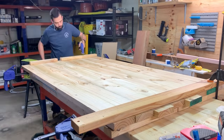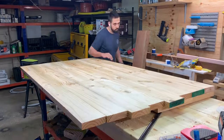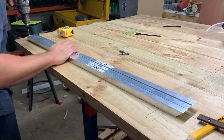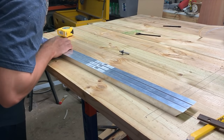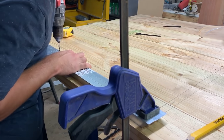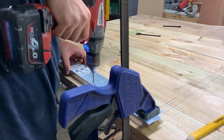The next day I took all my clamps off. After that I flipped the table so I could start looking at how I'm going to reinforce it. I chose to use aluminium C-channel because it's super light and really cheap — I didn't want anything too heavy. I drilled holes all the way throughout the channel so I could screw them down to the timber.